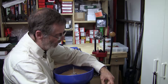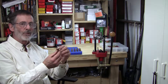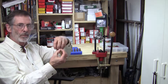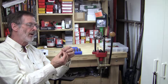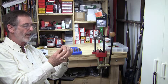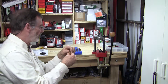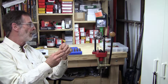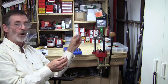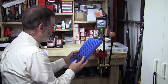The last thing to pay attention to — because this is rifle ammunition and we had to lube the inside of the neck — it's possible, especially if the lube builds up on the plug in the die, that clumps of lube come off and get deposited right inside the base of the neck as the case is being extracted. If you're doing 50, 100, 200, or 500 rifle rounds, you aren't going to be stopping regularly to check if lube is being deposited on the plug.